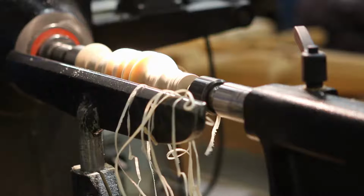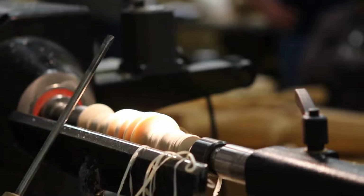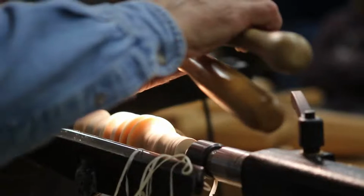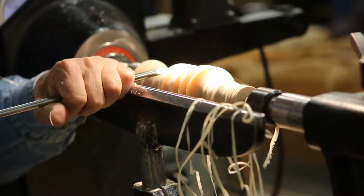The chisel that I use, I know I'm running out of time, so I'm just going to jump around. The chisel that I use most of the time for that is a type of skew chisel. It's made from round stock. I thought I invented this, and then one day they showed up in the Packard catalog. The beauty of the round chisel, this doesn't have an angle, although it could have an angle. Okay, so the round chisels could have an angle like this one, right? Or it could be straight across like this one. These go into very small spaces where a larger skew chisel wouldn't go. And this is very good for doing inside corners and those kind of details in small spaces.